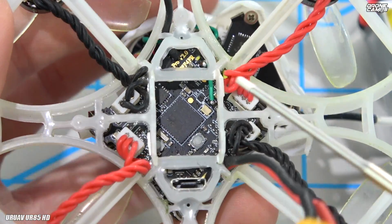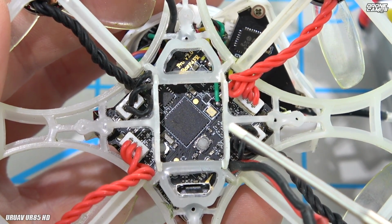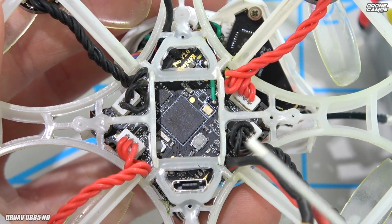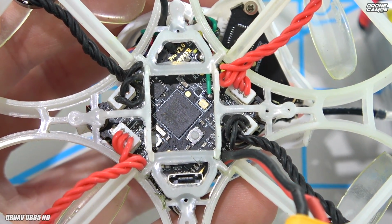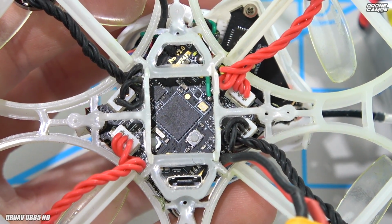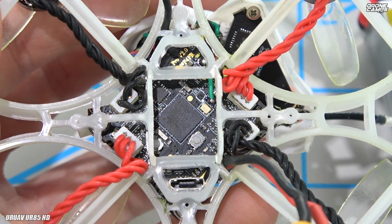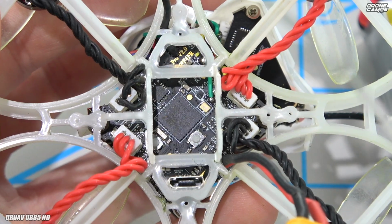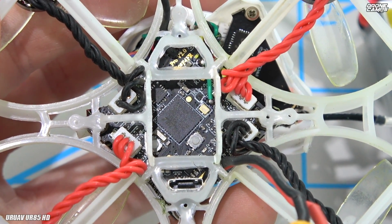But I do like, again, that everything is plug and play here. We've got 5 amp D-Shot ESCs, and you can also set it up to beep inside Betaflight. You can set up the beacon prompt on the configuration page, which is super awesome. So activate that. It's running D-Shot 600, and that buzzer is ready to go. So even if you flick a switch on your transmitter, you set that up inside your switches menu, in your modes, you can do that from a switch as well. So that's kind of nice to have just a little bit of beep out in the grass if you lose it.